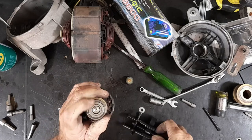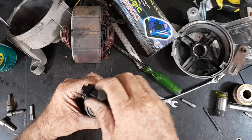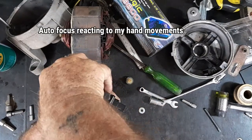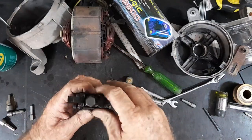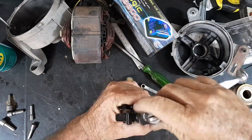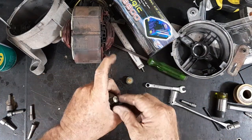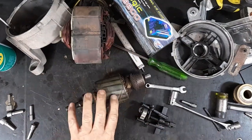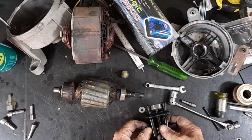One of the little screws I use to hold the timber panels on the back of the lathe sits in there quite nicely and it's about the same size as that shaft. Alright, one bearing down, one to go. I'll have to wait till the bigger puller gets here because this little one won't reach down there — that bearing is absolutely knackered, and that one's not much better.